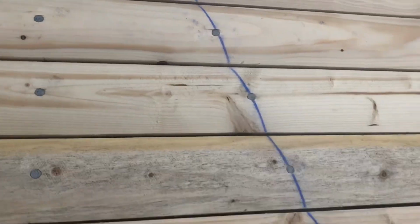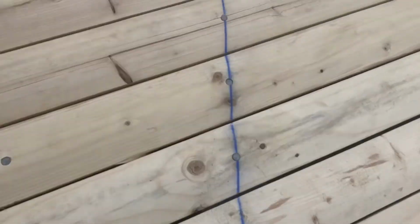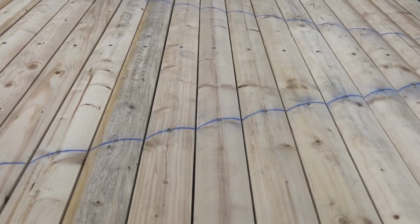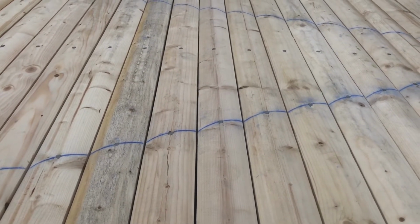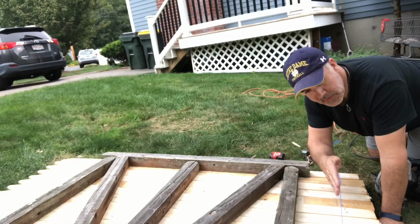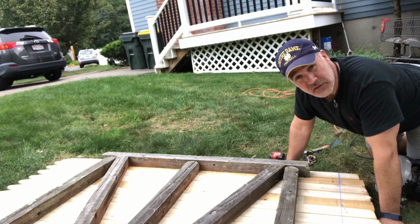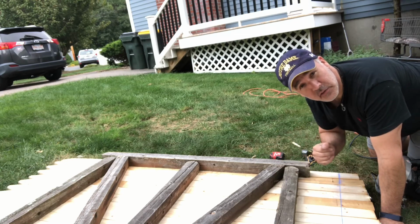See how nice that's gonna look just because they're perfectly straight, and it does catch people's eye. And you can see we have nice separation, just putting the nail between each picket lines them up perfectly. So the bottom of the fence is not level because of my yard, so that's a 2.5 inch difference. So I snapped the chalk line and then I'm going to cut that, and that's going to go right to the contour of the lawn.